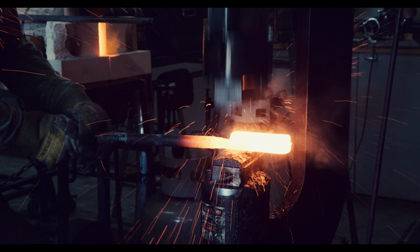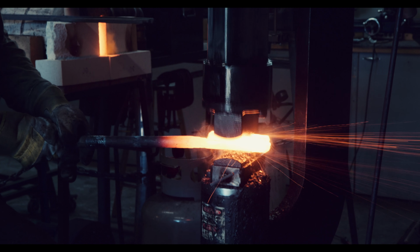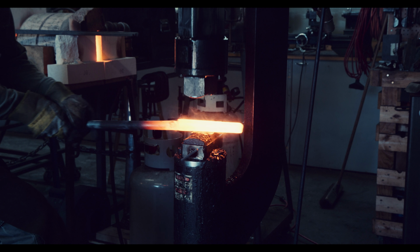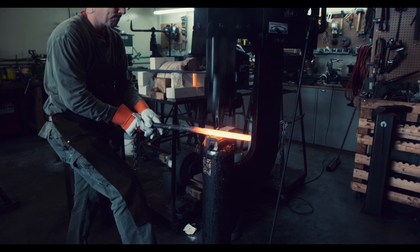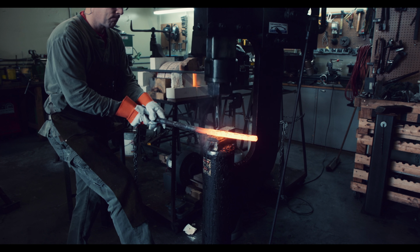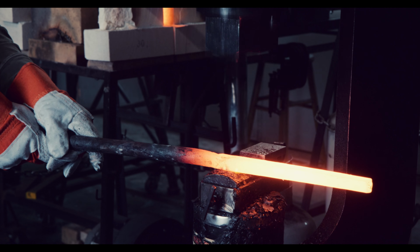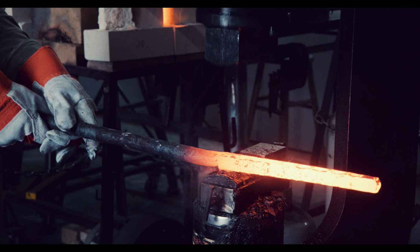I have now folded the wrought iron a third time and will forge weld it again. As a reminder, the bloomery process reaches temperatures in which the impurities are molten and removed from the iron, which remains as a sponge. I made a video on this a few years ago, so please check that. However, the forge welding process may also help with further removing some of these retained impurities. The ultimate test is if the wrought iron can be twisted without coming apart.